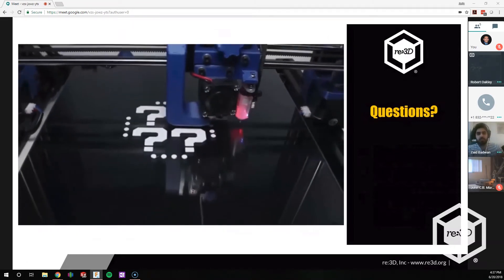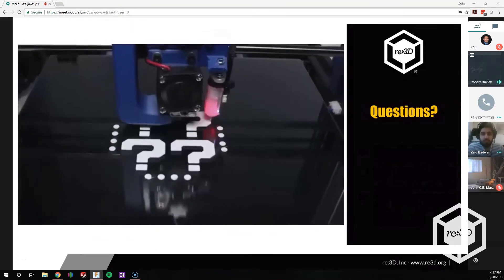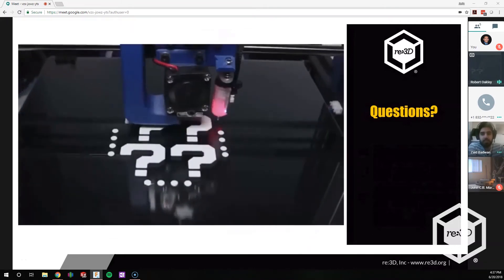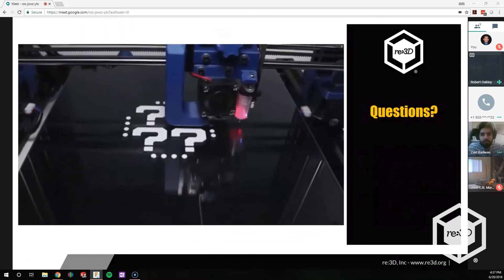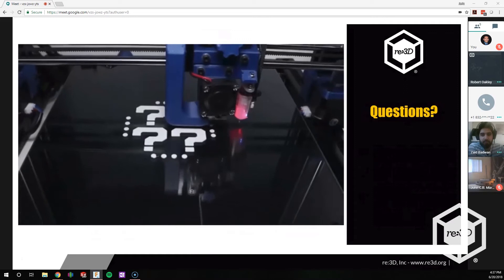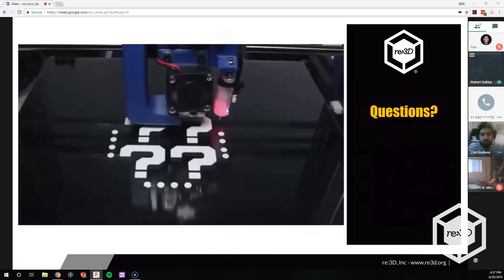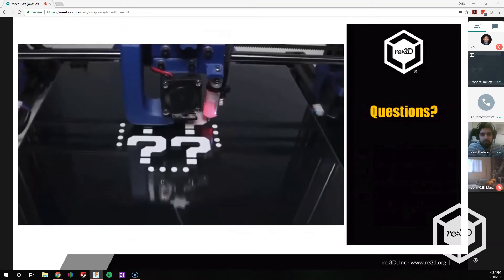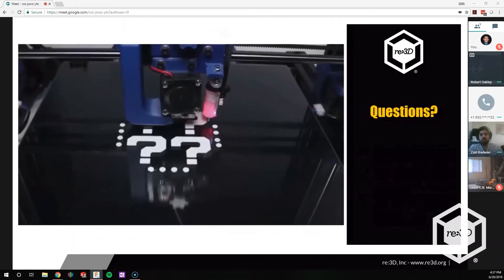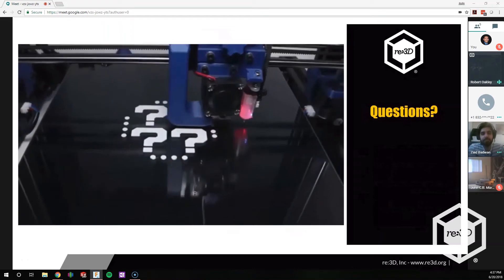To address that — yeah, we're definitely considering a gravity/hanging hopper, because it's a more affordable cost than any sort of vacuum feeding. We do want to offer a more industrial option eventually as well. Just hanging is one of the things we already have a hopper design for, and we're actually looking at using CPAP sleeping machine hoses because they're super flexible. We're evaluating what that would look like mounted on the machine.